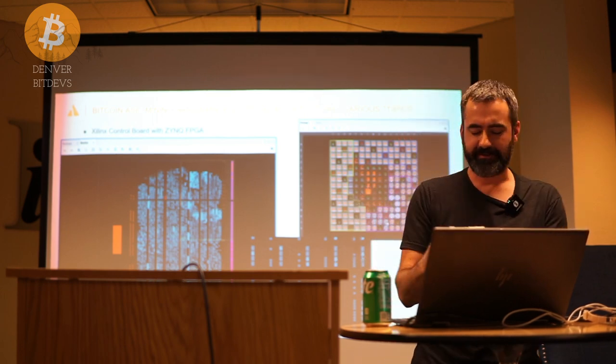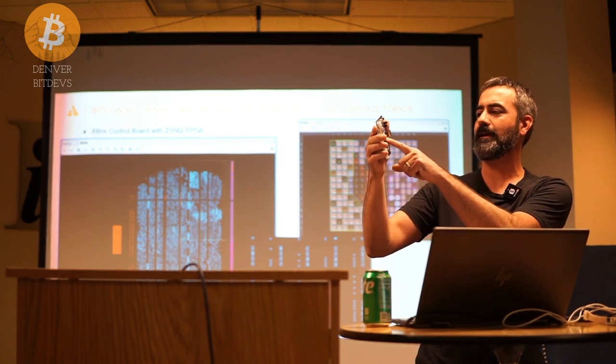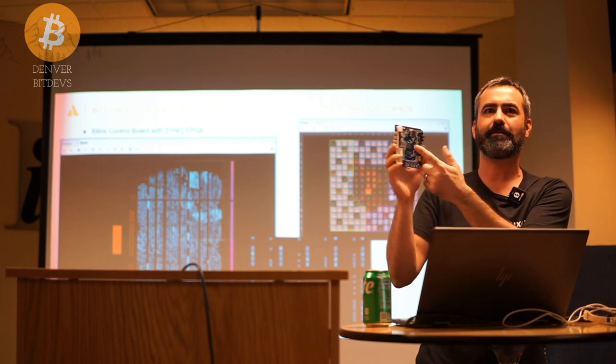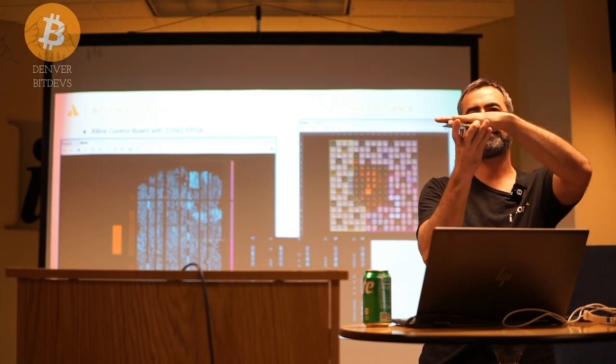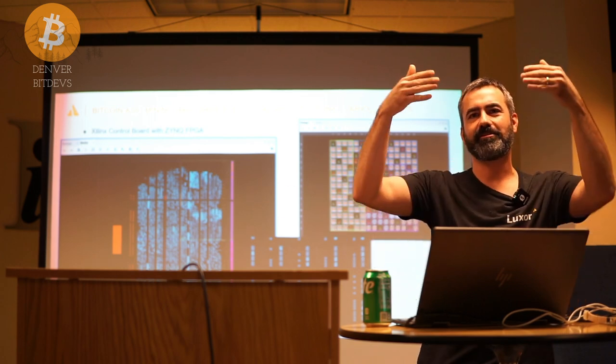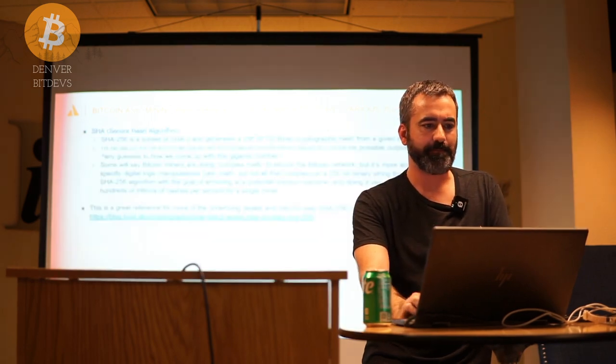If you look really close on this board, you can see the row of letters and numbers. And that maps the physical pins. It's called a BGA chipset, or a ball grid array. And it has this grid of pins. Whereas those ASIC chips, that picture I showed you, had pins on the edges. So a little bit different pinout design.